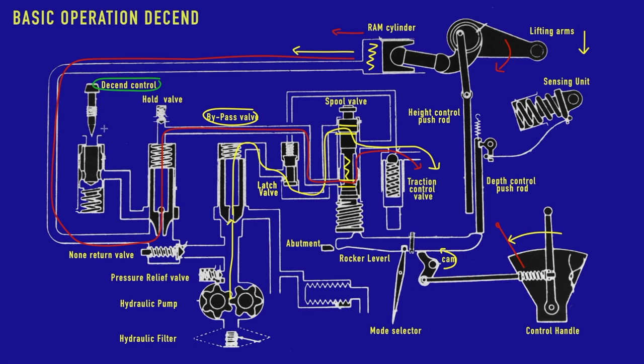I should mention the descent control valve — this is the knob you can turn manually clockwise or anti-clockwise to affect the speed of descent. If you have a heavy weight on your lifting arms, you don't want it moving the ram cylinder down so fast that it hits the ground. You can turn in the descent control screw, which is a large knob, to reduce the leakage effect of the hold valve. By turning the descent control you can control the rate of descent of the lifting arms depending on the load.